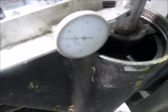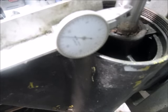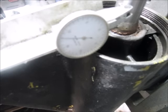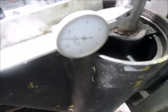The fluctuation you see is probably me pulling it against the bearing, so this shaft is very straight. It could be out up to about four thousandths — after that it's going to cause problems: it'll vibrate too much, wear out the seals, and cause the clutch dog to chatter. The more warped it is, the faster it wears the seals. In my experience, if it's six or eight thou, you get maybe twenty hours before the seals wear out again after you replace them.